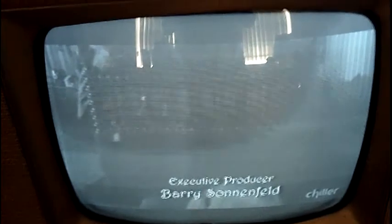Let me adjust this again. I don't think it even has an antenna hooked up — that's me just touching it. Actually, I'm going to have to look at the picture centering and see if I can get that sorted. Make sure it's centered properly and it's not due to a weak rectifier keeping the B-plus down.